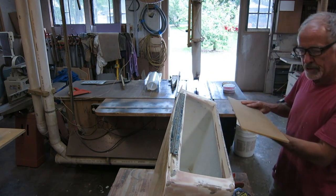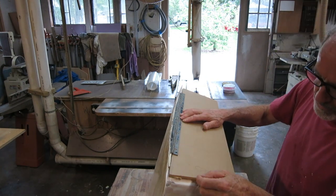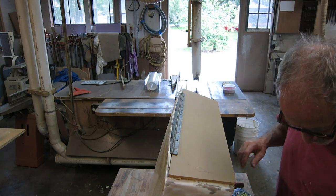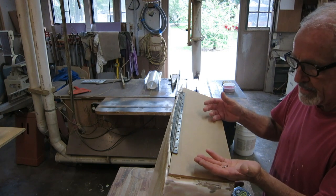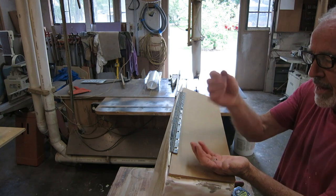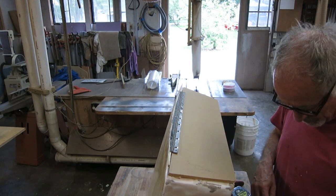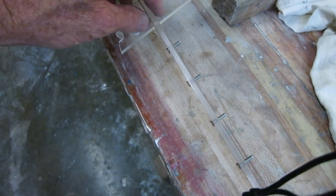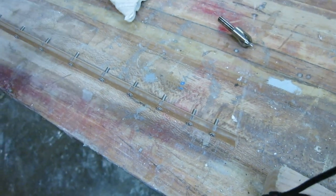This is the plexiglass cover and it's only a quarter inch thick. You can't really put a nut on the backside or it'll have interference. So I'm going to attempt to use these 6-32 stainless screws, drill and tap them into the plastic, and cut them flush on the back. If they strip out, I can put them from the back and put a little castle nut on the top, but I don't have those kind of nuts, so I'll try drilling and tapping first and see if it holds. I've got the right bit and tap, I've got them marked. I've got 10 screws screwed through this scrap of plexiglass — I used 10 different holes because I figured I'm going to melt the plexiglass at every one — and I'll put this in the vise and cut them.